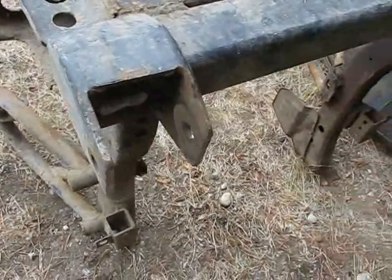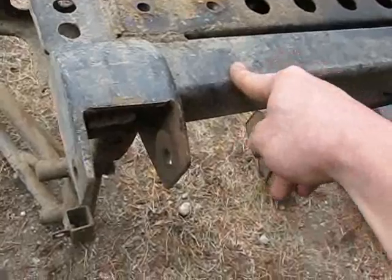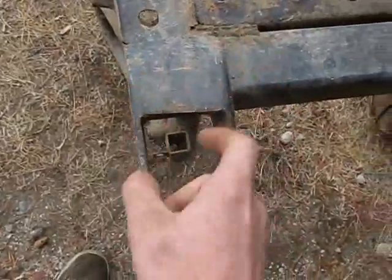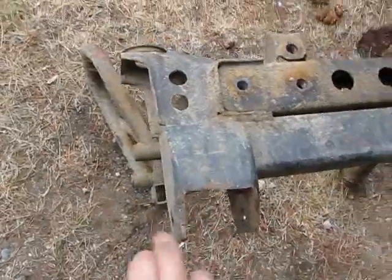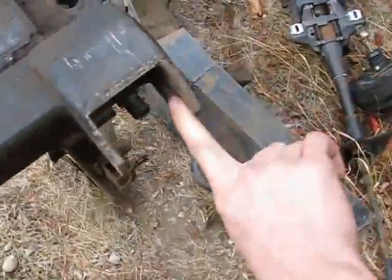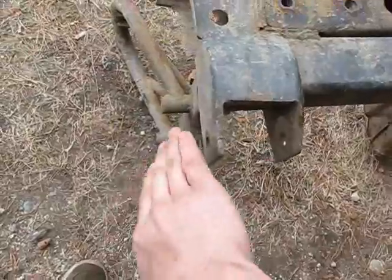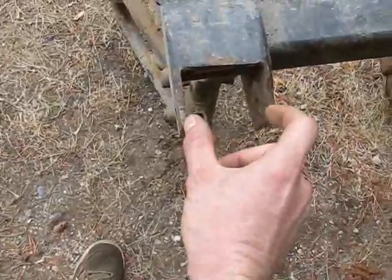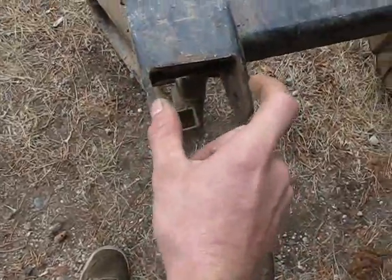But yeah, I got this piece cut, I think it's 32.5, don't quote me on that. But all I did to measure was on the stock hangers, I measured from the inside of the outside tab on both ends, and then I got them to cut the square tube to that. That way, it's perfectly aligned and everything. I measured the spring bushing that goes inside the spring, and then I got the spacing for the width for both of them that way.